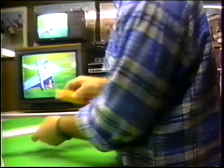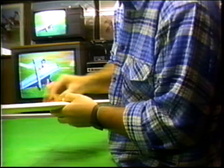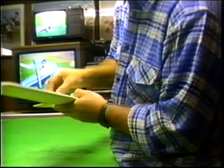There's a couple little spots here I had to touch up with some DAP, and I just want to get them. I'll work on the elevators first. Always with a block, and always from this point on with 400. Nothing but 400. Get the wood joints real nice.